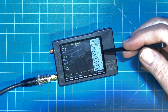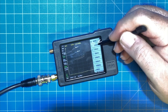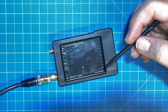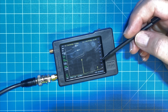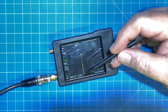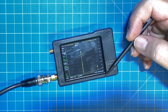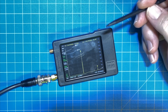Let's go look at our resolution bandwidth — that's on auto. Let's change our resolution bandwidth to 100 kHz. You can see our scanning speed down there on the bottom, that little green line. Let's key up again. It'll have to sweep a couple of times. You see as it goes, it's getting more data each time. The TinySA has a limited number of data points, so based on the range in megahertz divided by the data points, we're a little less than one megahertz per data point. But we're going to end up with the same results — this is about minus 30, and this is over minus 80. Same kind of results.